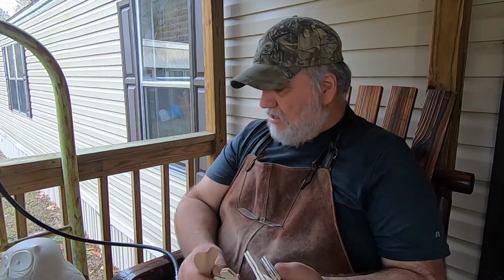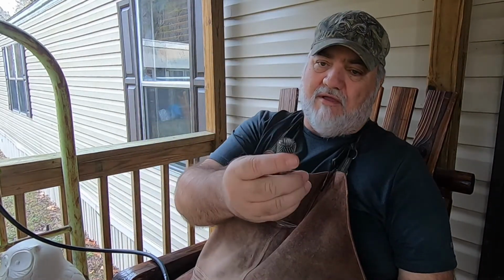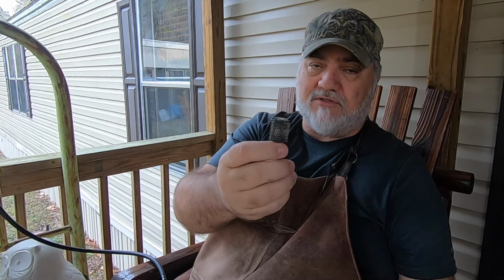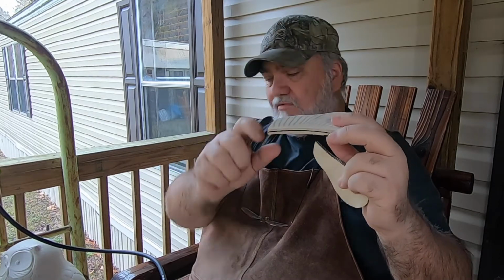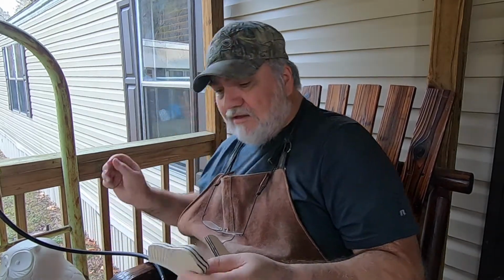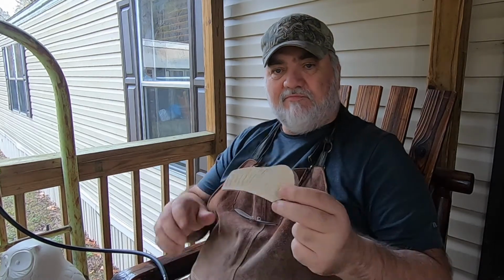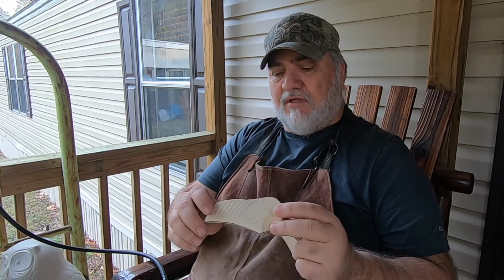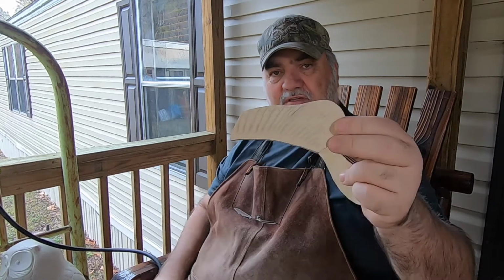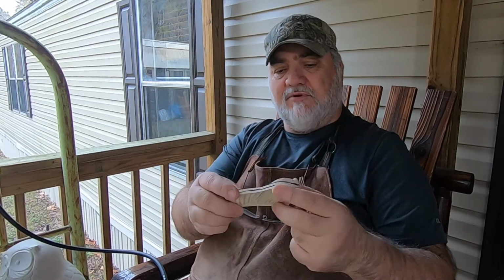So I'm going to work on those. As a matter of fact, I used this big coarse cutsaw on the ones yesterday to take the thickness down to the center line. And it's just too rough. The final product is just too rough and it's hard to sand smooth. So what I'm gonna do is take these down a little bit closer on the belt sander so the finish is a lot smoother.